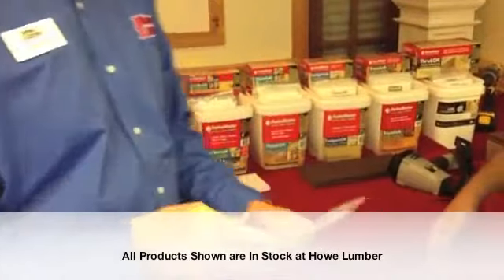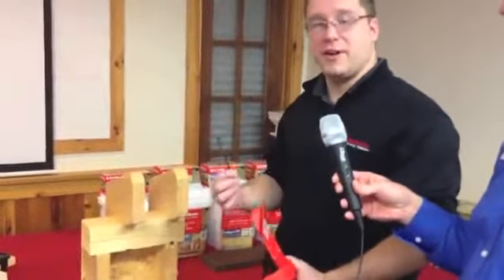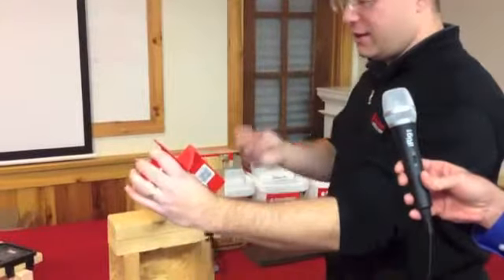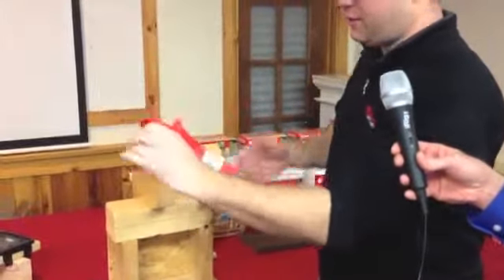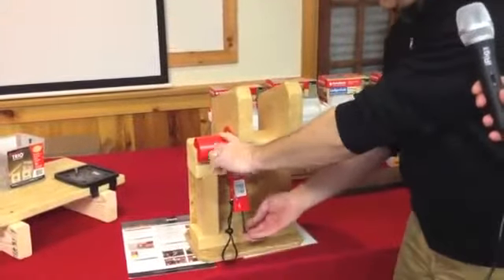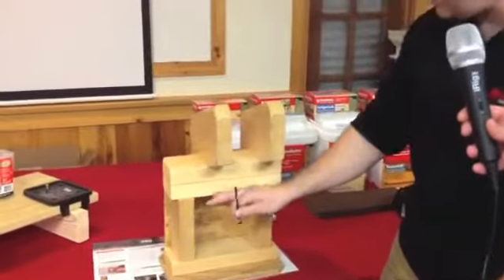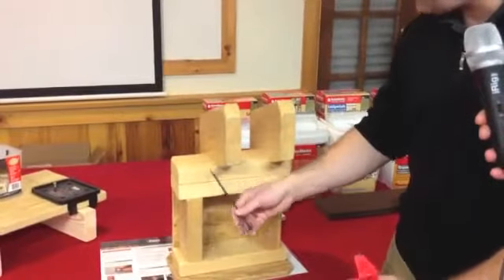You can see the black screw with the hex head — that's going to be your Timberlock. One of the best new applications for the Timberlock is replacing a hurricane tie and your ten nails. One six-inch Timberlock will replace your hurricane tie. We have a red Timberlock guide that gets you at the right angle, twenty-two and a half degrees. You set it in magnetically, use your hand to position your rafter or truss, set it up to your double top plate, drive it in a couple inches, pull it away, and drive it up the rest of the way. Every Timberlock head will countersink away from your drywall, and the threads engage the bottom cord of your truss or the bird's mouth on your hand-cut rafter and pull everything together.